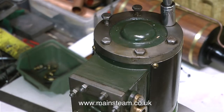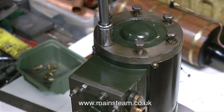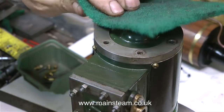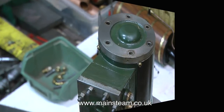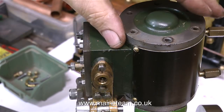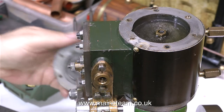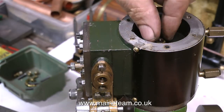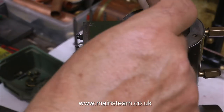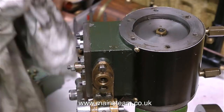I'll have a quick look in the cylinder. I'm removing the bolts from the cylinder cover, and I'm not too thrilled about all this rubbish coming out with the bolts — I think it's that rubbery stuff again. Getting the cylinder cover off is one hell of a job. I've tried all the normal methods with my small craft knife, and in the end had to use a brand new Stanley knife blade to persuade the cylinder cover to leave the cylinder, because it was firmly stuck with this rubbery stuff. I even had to scrape off more rubber from around the top.